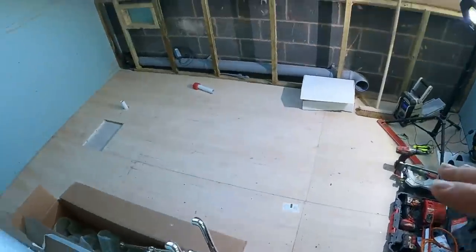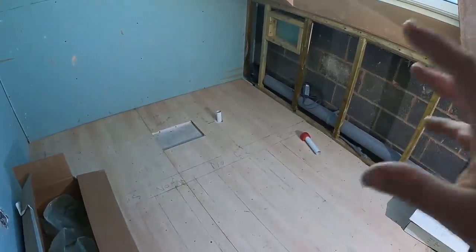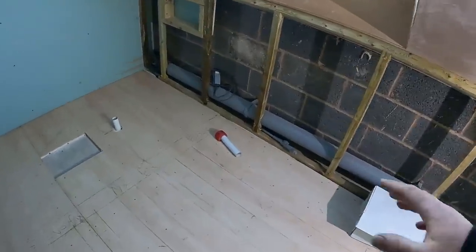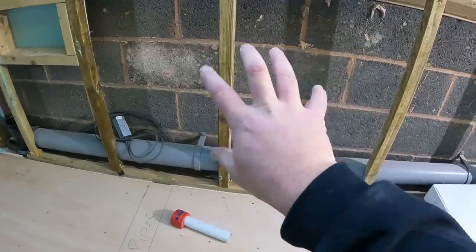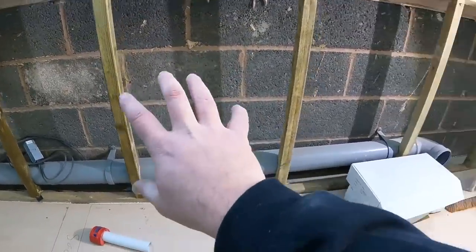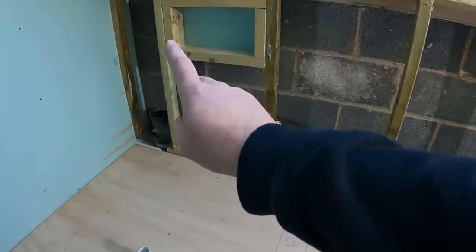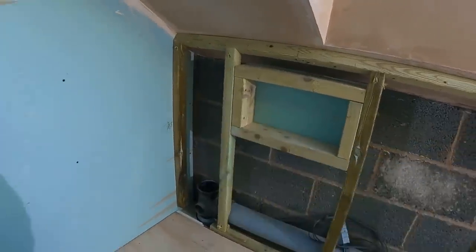As I said before, we're going to be here for a while, but today we're doing a little bit of proper plumbing, as I call it. Yes, the underfloor heating has been proper plumbing, and it's over there. The lads are putting the boards down, as you'd have seen in the other video. But today we're now shifting over to getting all the pipework in and first fixing slash second fixing of these bathrooms. So we've got hot and colds coming up here. So we've got to put them where the basin's going to go. Toilet's going there, so that's not an issue. Then on the waste, we've got to come up, put a Durgo on the top of there, air admittance valve on the top of there.